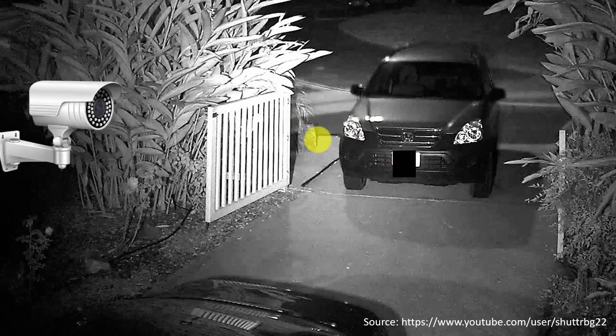Here's an example. The camera has some LEDs, and those LEDs throw light onto the object — in this case, a car. The light bounces off the car, comes back to the camera, and comes through the lens. It's better to remove the filter so there is no obstacle — the light comes directly into your camera. That's the idea of ICR: you remove the filter and the camera does this automatically.